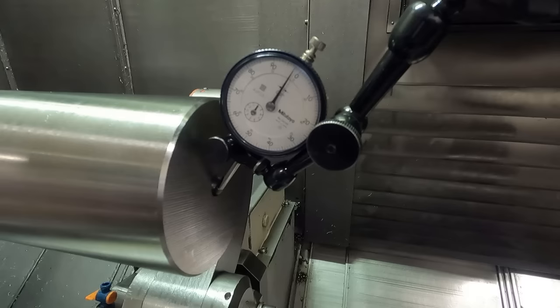I just put enough, just a little bit of oil in this, because if I fill it up full, like I said earlier, it'll just run continuously and run the oil through the steady rest, whether I'm using it or not, and it gets in the chip pan, the chip conveyor and everything. So I just put enough in here to get it to go a little bit. And this I've determined is about the amount I need to reset it. Right now it's setting,